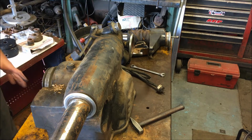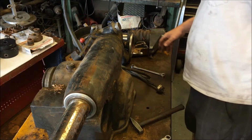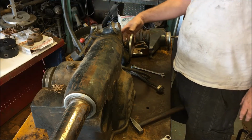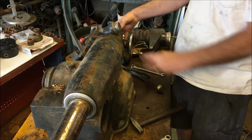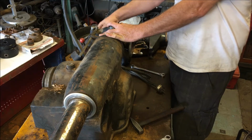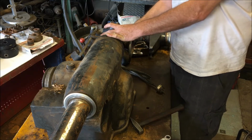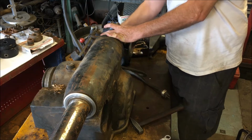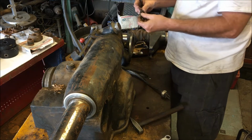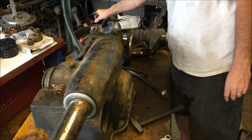Okay, so I got that machine apart so I can get around this thing easier. Now comes taking this end apart. I'm basically just going to pull the end cap off of here, pull the bearing off, take this whole cover off, and then unscrew this shaft without the gearbox being engaged. Somebody's already been messing around. They don't have the right stuff over here to begin with. They still have the double D washer, but this is supposed to be a spring washer, like a wave washer.